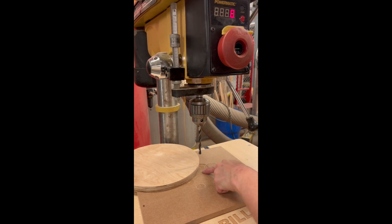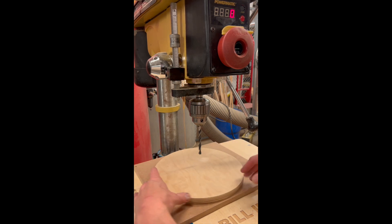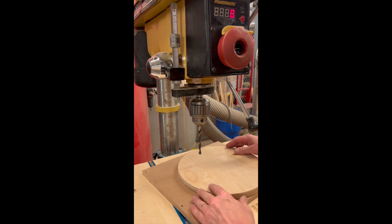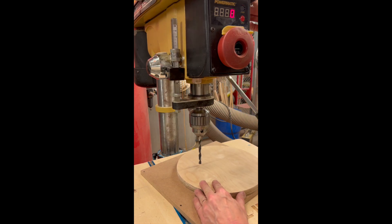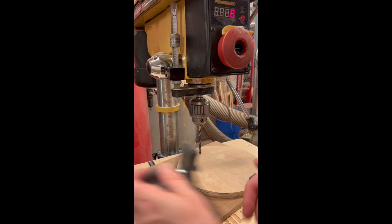While I was doing that I was holding the drill bit such that it won't go all the way through my workpiece. Now I can position my workpiece so that one of the divots from the drill centers is directly under my five sixteenths inch bit, and just like before I can use hold downs to immobilize my workpiece.